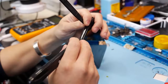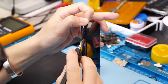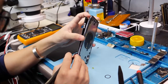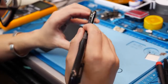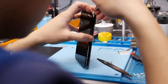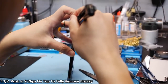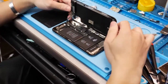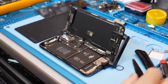Do comment below if you're that one person who actually does this. We start with removing the display on the iPhone X — much like the iPhone 7 and 8 series, it opens up to the right. When opening it up we try to preserve the existing waterproof seal. I would recommend buying a new waterproofing seal to replace after doing this, or Trung would do that for you. You could also preserve your existing one if you're very careful in cutting it open.